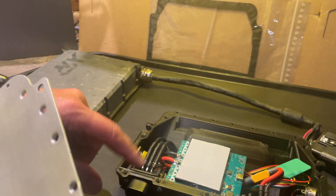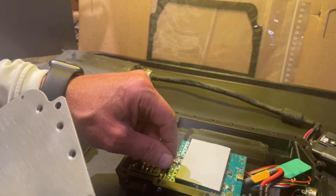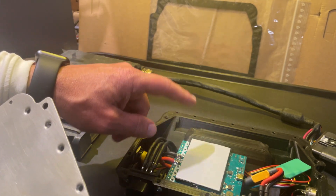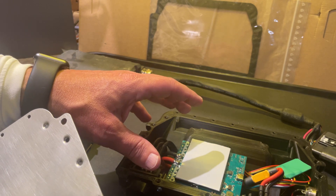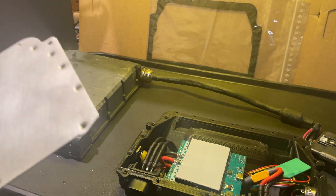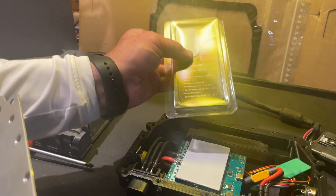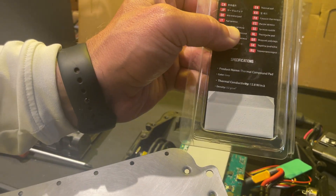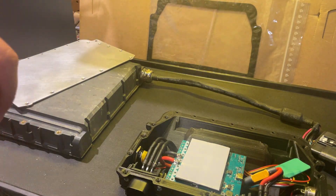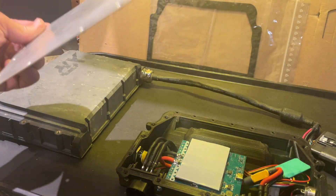I kind of regret not getting a thicker thermal pad. The thermal pad is not optional — without it, your MOSFETs will fry instantly as soon as you power the motor. I know because on my very first fun wheel build, I didn't have the pad yet and powered it on, and they fried. You want to look for thermal conductivity of 12.8 watts per meter-kelvin. The cheap stuff has around 6 watts — you really want the maximum possible to keep your MOSFETs cool.